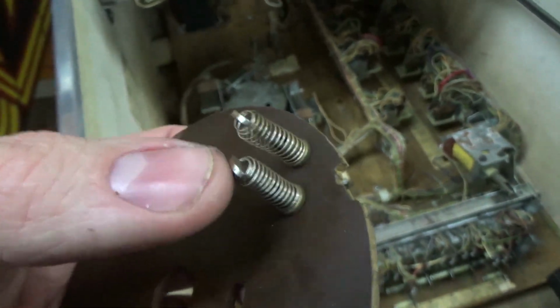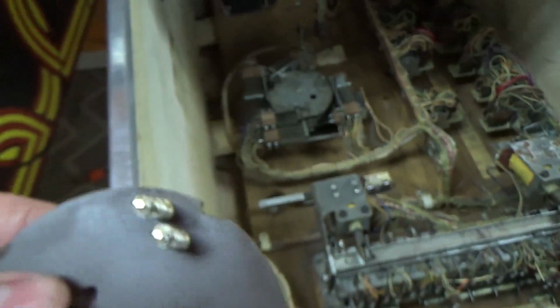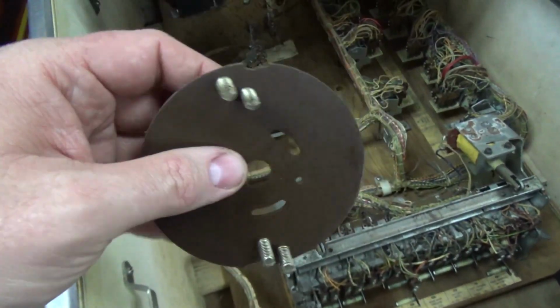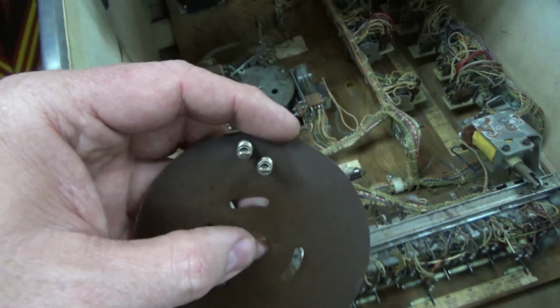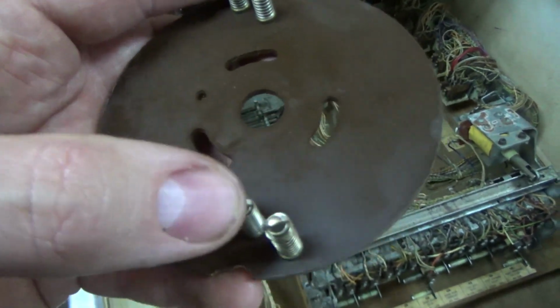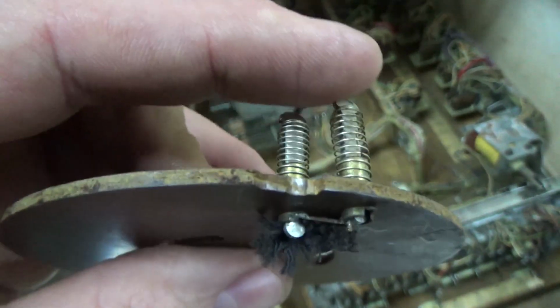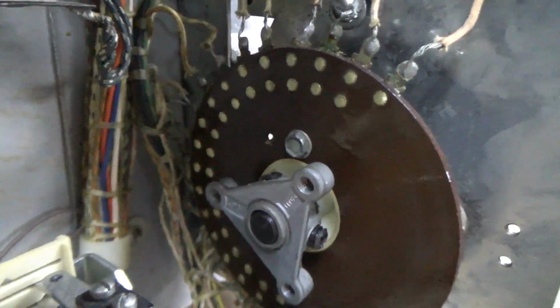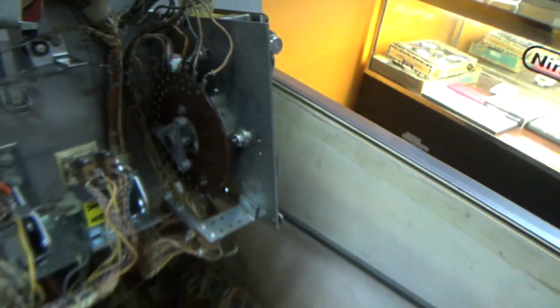But so the rivets, you're trying to see where they line up, right? Well, here's the little side indent. There's two of them. So that means whenever it turns, remember I was saying it turns until that switch opens up again? So it would turn a half turn, okay? And then there's only 2 rivets, and all they are doing is connecting those 2 contacts, whatever it's sitting on, together, okay? So you see how they're kind of diagonal? They're not perfectly lined up. It's actually connecting that one and this one, so it's like a slanted thing, right?